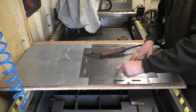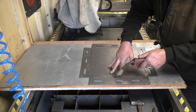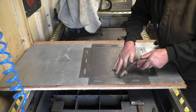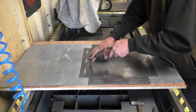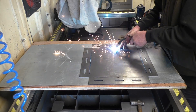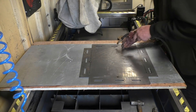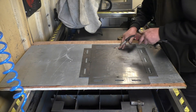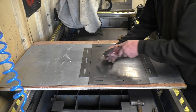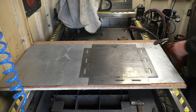The idea is to fold these up along the lines, but I should have left a couple of little pieces in there just to stop them moving when I fold it. I'm just going to put a little tack weld in the centre to stop it from moving. We've got four decent tacks on there now. We'll grind them flat, then fold it over and weld on the outside.